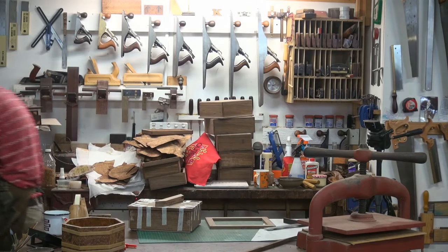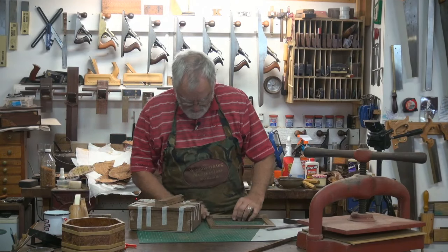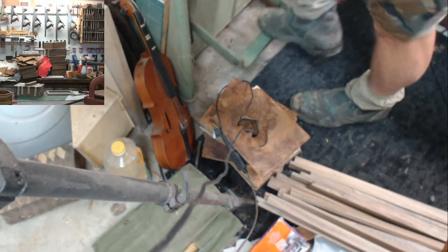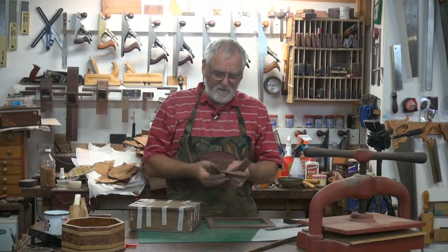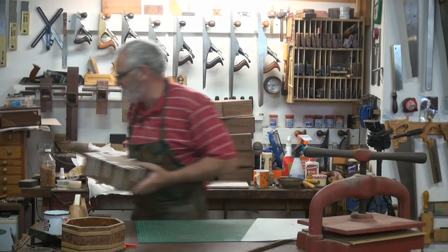I know why it's out. It's out because I'm using a thicker piece of timber, or not thicker, but wider. And being wider, there you go, that's good. It puts your measurements out just a little bit. Okay, so we'll move that up to there. Tighten that. Slide that into there. Let's change the camera around. Okay. All right. So there's our four bits, but you can see how having that fence set up, you can just barrel through and do 50 components at a time if you need to.